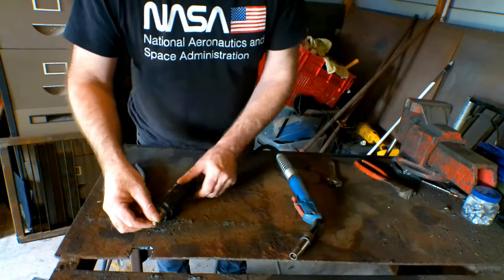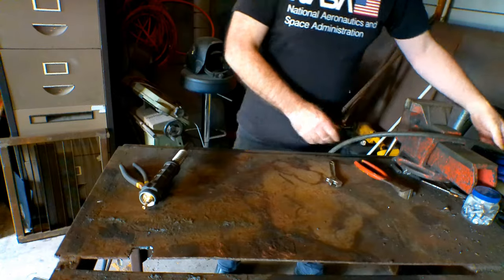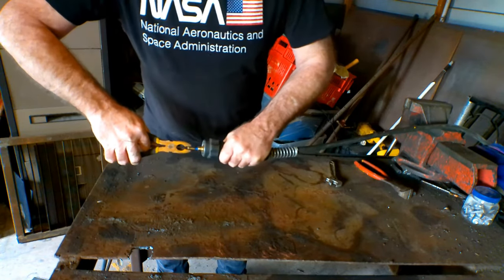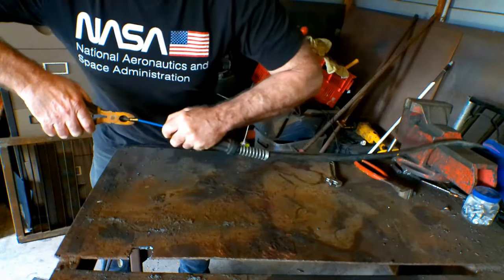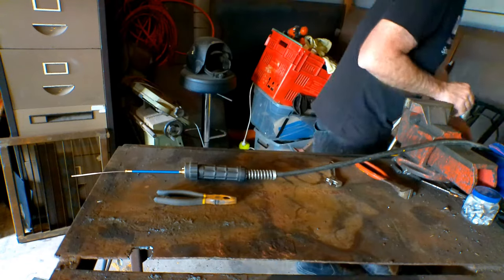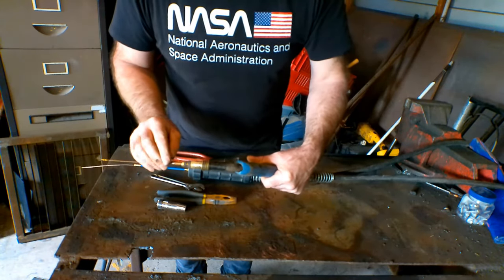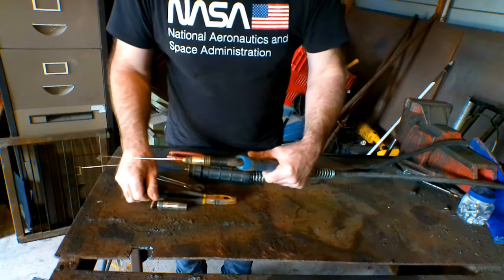So what we have to do guys is actually pull out the liner here. To do that we have to lay the gun out flat — I'll just drape them over this end of the table. So I've got the gun running flat that way. What I do now is just grab the liner here and pull. The flatter you've got it, the easier it should come out. Doesn't want to come out, so we're going to grab the other end and disassemble all that first. Sometimes you can get away with it and sometimes you can't — it depends where your wire's stuck. So take your nozzle off, then take your contact tip off. Sometimes you might find that the wire is also stuck in your contact tip — you may have to put pliers on there after you unscrew it and give it a yank. That one comes off alright, so that just proves our wire's bent up somewhere in the liner.